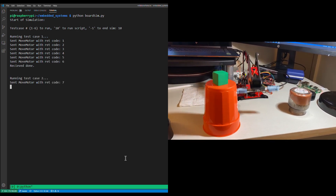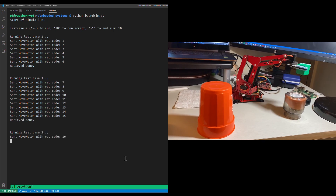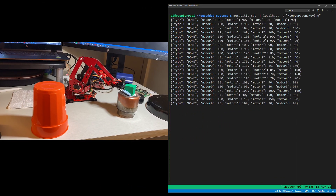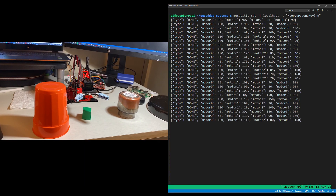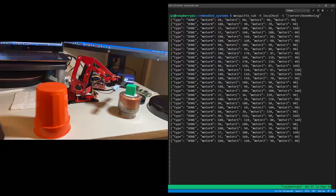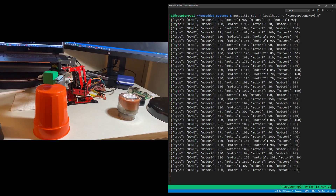The TI board is subscribing to that message and moving the arm. After that, it sends a message back to the simulation script that is also subscribed. On the right side of the screen, you can see it's a Mosquitto subscriber subscribed to server slash done moving. Each time the TI board has completed its complex movement, it publishes a done command to let the server know that it has finished moving.